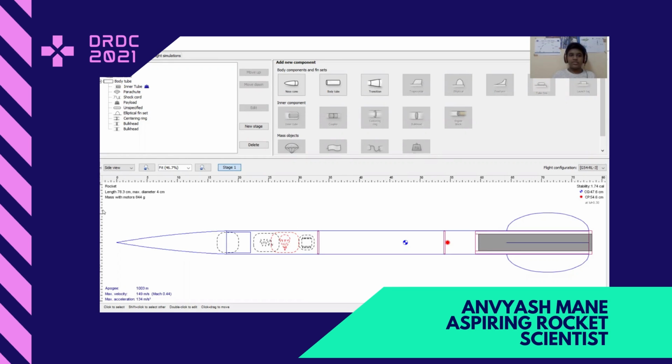Starting from the basic things of the rocket, its length is 78.3, the diameter is 4, the mass with the motors is 844 grams, the apogee is 1003 meters, and the velocity is 149 meters per second. Max acceleration is 134 meters per second squared, the stability is 1.74, the CG is 47.6 centimeters away from the nose cone tip, and the CP is 54.6 centimeters away from the nose cone tip.